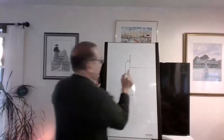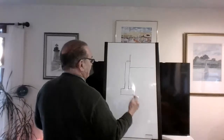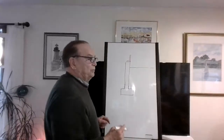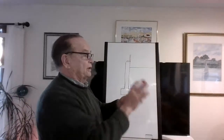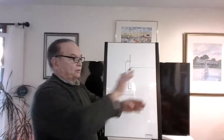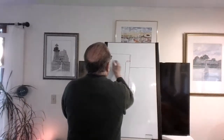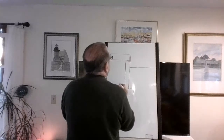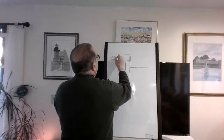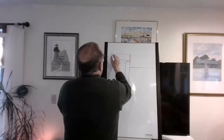Now, looking at it this way, the house is going to be running to our left. We're standing at the corner of the house. This is the ground. All right, so this here, I believe they call that a rim joist. So the ends of the 2-bys that go right to the outside need one piece to make it all the way around the house. So at either end, you have these here. And this would usually be a 2x10 like that. Okay, now at the top of that, this would be a 2x10. The top of this here is the subfloor.